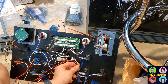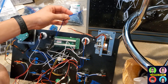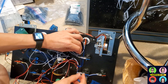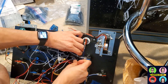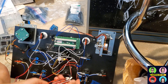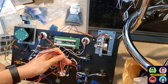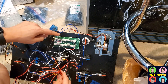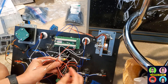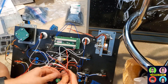I add some extra heat shrink tube for protection, tie it down, and use the heat shrink gun. Now it's all in one giant ground — these are two ground wires spliced into this single ground. This will come down, I'll add another heat shrink tube, and the grounds all connect into this quick connect. That's how you connect multiple ground wires into a single ground outlet — splice them into one or two cables and get just a few going in instead of 13 separate cables.